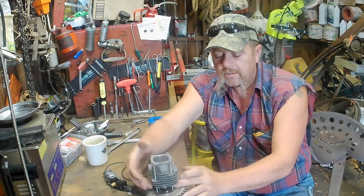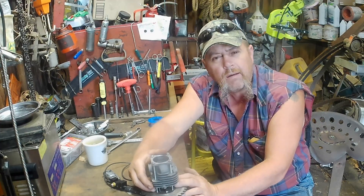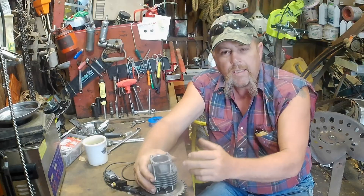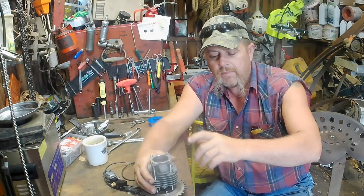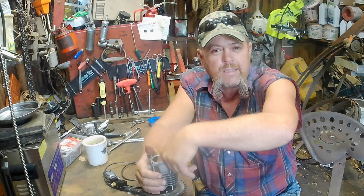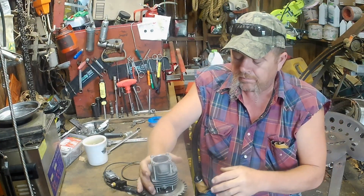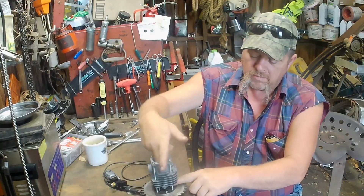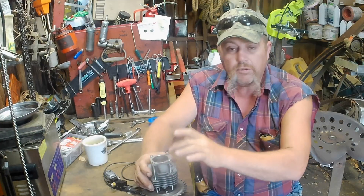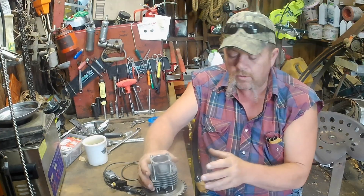The steel's got a fin on top here, and I just run a piece of quarter inch key stock. There's a boss in there, and I run a quarter inch piece of key stock and bridge that hole. That boss sits on that key stock. Now I get to move the bottom of this independent of the top, just like you would with a fixture and a four jaw chuck. I can bump this bottom around as I go and get that started centering up. When zeroing back here I knock the bottom, and when zeroing out here I'm changing it with these bolts - loosen one, tighten the other. Same thing you do on a four jaw chuck.